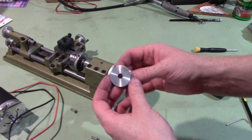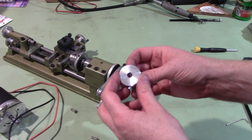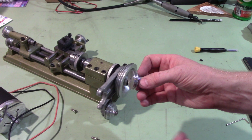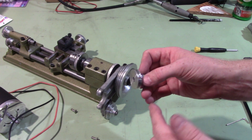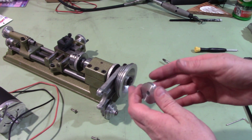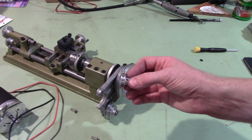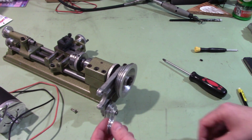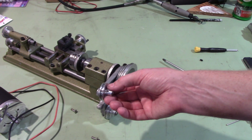Here's the completed pulley. I think it turned out all right considering I don't really know how to use a lathe — and that was by far the most complicated part I've made. I was going to use the cross slide to set the angle and use a cutoff tool to make those angles, but turns out I don't really know how to do that. So I ended up using a file for a lot of it, but it turned out all right — it's pretty much dimensionally correct. Anyway, let's put this thing together and see if we can make it turn.